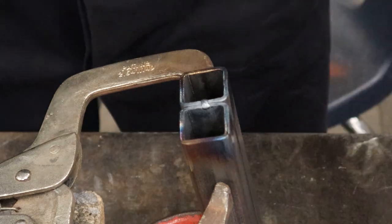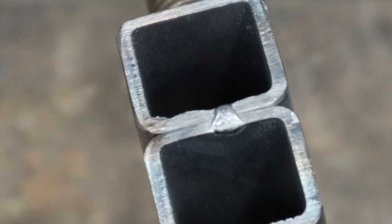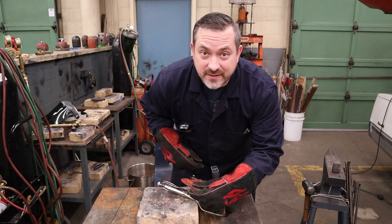I'm going right in the center so there's no warping or distorting. Once you've got both ends tacked, you don't need the clamps anymore — take them off and go drill that hole.